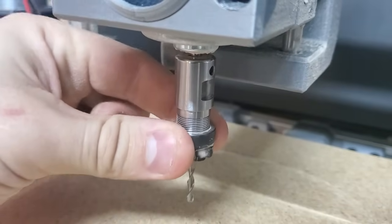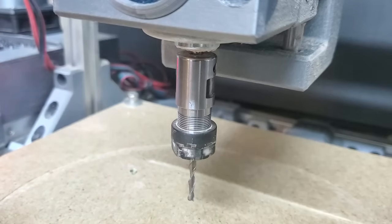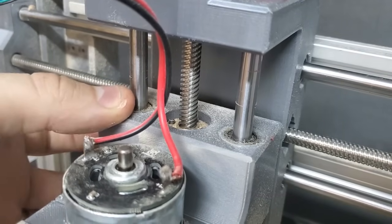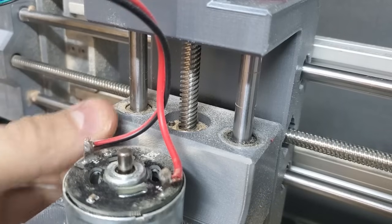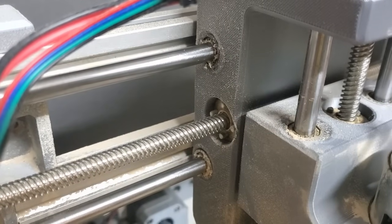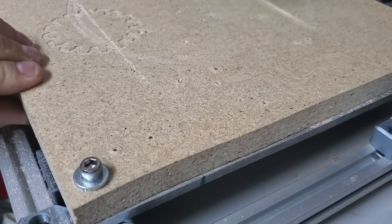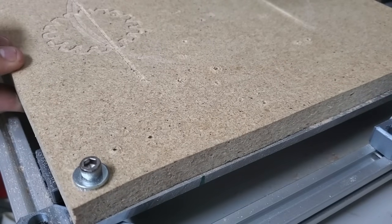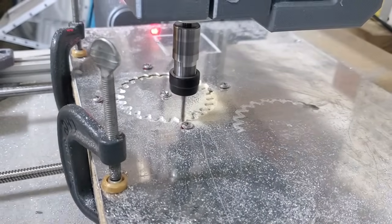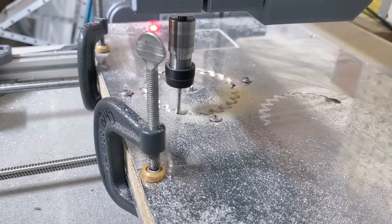You can see here what a huge amount of slop the head has — I can probably move it around 2 or 3mm in any direction. On a good mill the head should be absolutely rock solid. This comes from backlash in the Z and X lead screws combined with the fact that the 8mm rails are thin enough that they'll flex under a little bit of load. The backlash could be eliminated by tightening two nuts against each other on the lead screw at the expense of extra friction. As for the rails, they just need to be a whole lot thicker or be replaced by true linear rails bolted to a frame. Keeping these limitations in mind, I'm going to go ahead and try to cut some aluminum parts and see how good or bad they turn out.